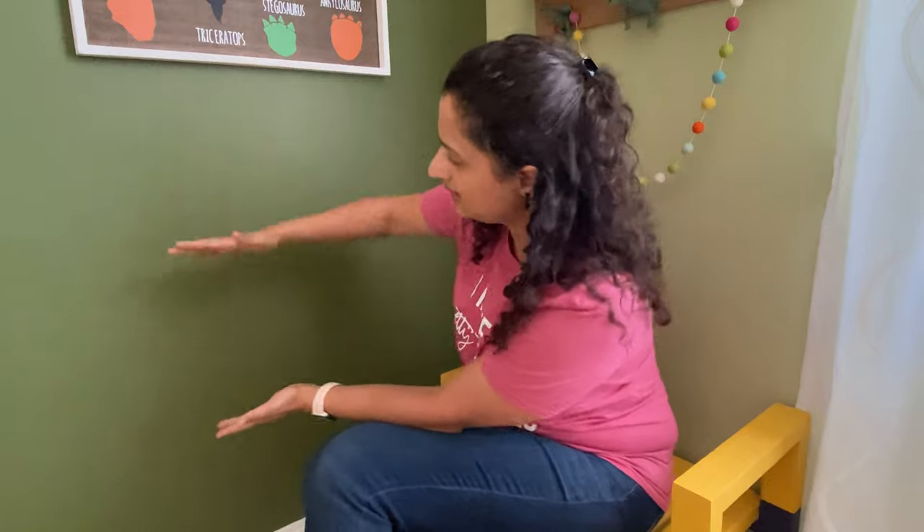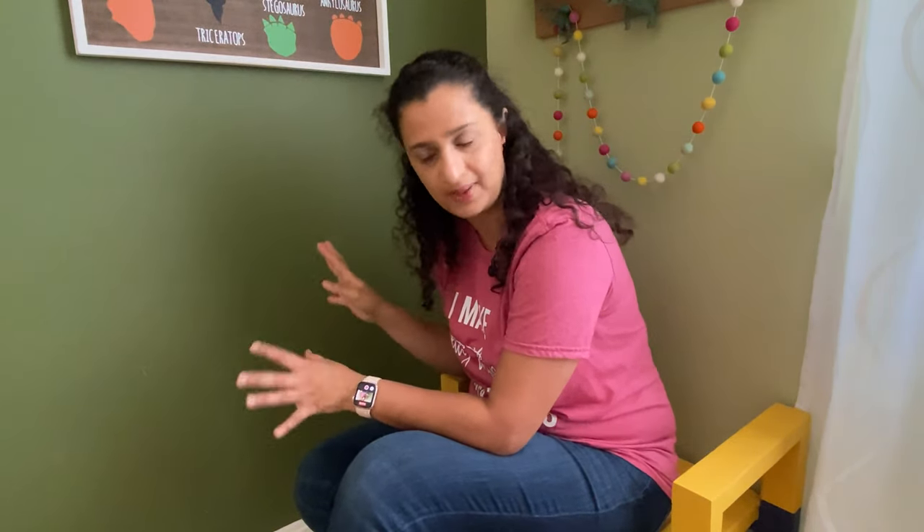To install the shelves I could line them up, I could stagger them — you could do any configuration you like, but the important part is that you hit at least two studs on each of the shelves. It is important to hit the studs and I will show you why when we install the hangers.